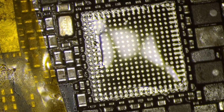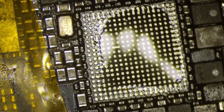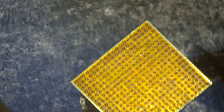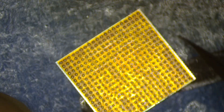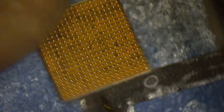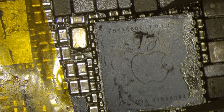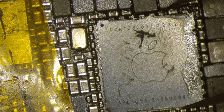After you've tinned and braided the board, cleanup is very important. I cleaned it here with some alcohol and a brush. Before you install the new chip, it's very, very important to inspect it. Sometimes it may have uneven balls or the chip might be damaged — especially because if you bought it from China or wherever, you don't know if the chip is good or not. So it's always good to give it a visual inspection.